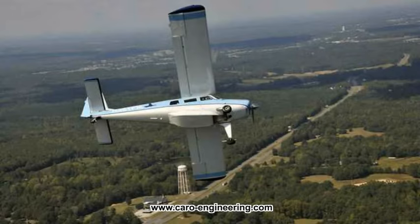No type of bearing can be totally ignored long term. Grease and oil dry up and parts corrode. They should be inspected annually, and if the friction in the system increases, the cause should be investigated. It is usually fixed easily with the proper lubrication.